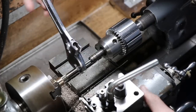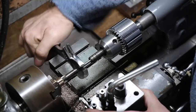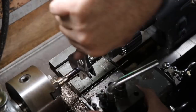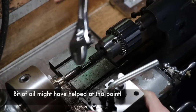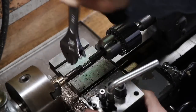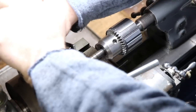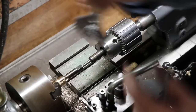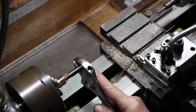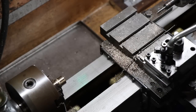It's good to have some clearance at the back of the tap so you can go right through the work and use all of the depth of the tap to cut the thread. Something I learnt from my earlier failures was to make sure that rear clearance shank was cut early on and was nice and parallel so you could hold it in the collet when you grind the tap. So there we go — success.